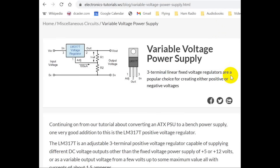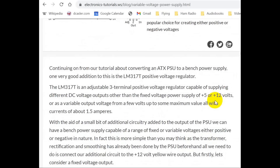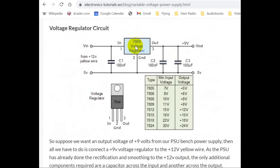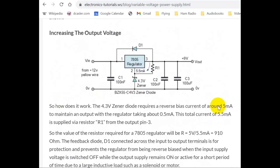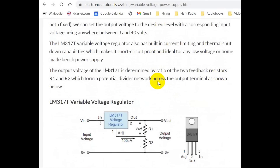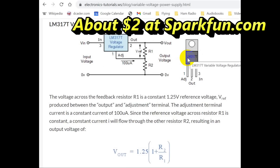The site gives several different circuit diagrams you can use for variable voltage supplies. As it turns out, we're going to use the one right at the top. These are fixed regulators where you can tell the voltage by the number at the end. There are different ways to increase the output voltage. For variable voltage supplies you use a variable resistor. Now we want to take a look at the LM317T variable voltage regulator — it's this device right here. They are dirt cheap.